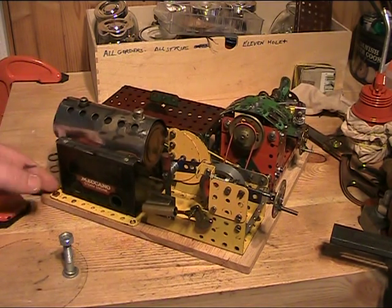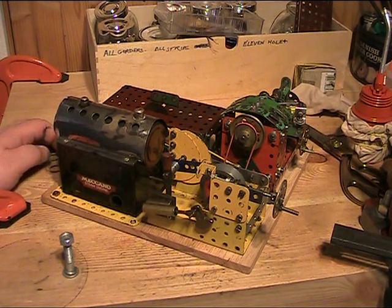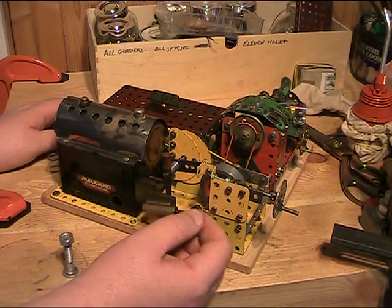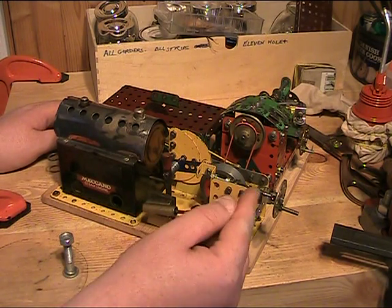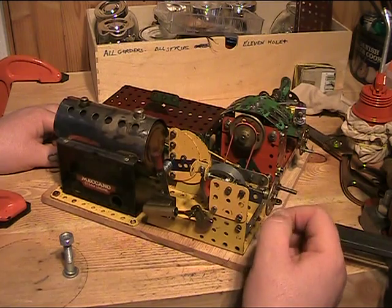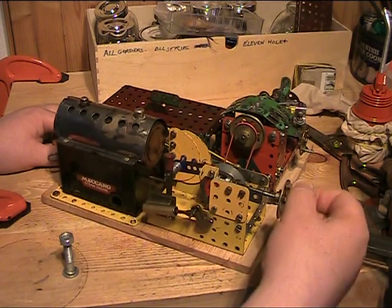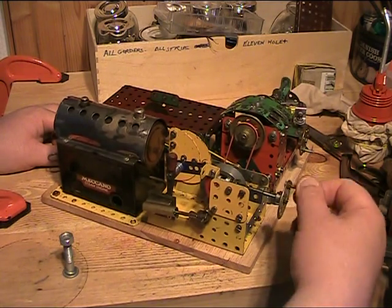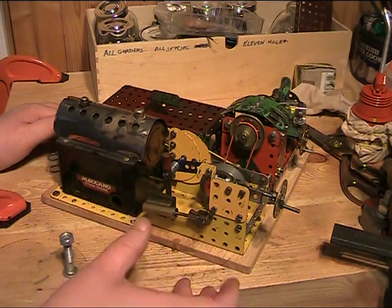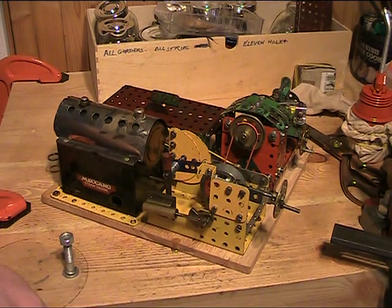Taking that a little bit further, what I've done is a simple screw reverser and speed control. Not unlike the beds on the tools, the tool beds on the lathe - it works just by encapsulating a nut on a threaded bar, and we rotate the control. I've had a lot of trouble trying to get it all the right length because I really need a threaded rod about half an inch longer to give me the right adjustment, so I had to cobble it a bit here and there, removing some washers to gain just a little bit extra.